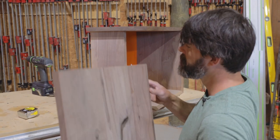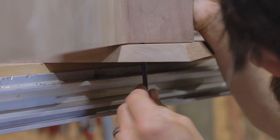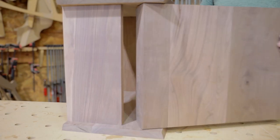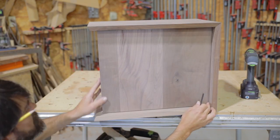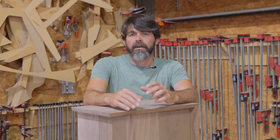Get two small bearings — place one in the bottom, one at the top. Put the portion of the top door in first and then slide it to the bottom bearing. You want to make sure that this door is totally flush with — in this case — the side of the cabinet. If it's not, you're going to want to move that little divot in the right direction to line it up. Put the door back on and try it again. Keep doing this until you're completely happy with where that door lines up.